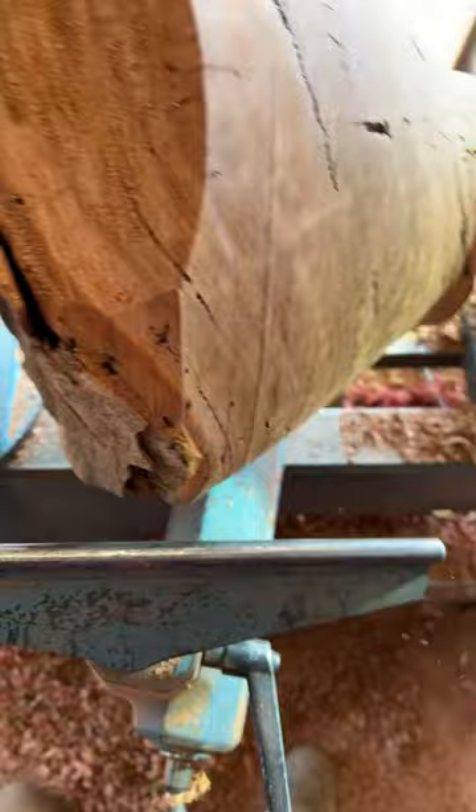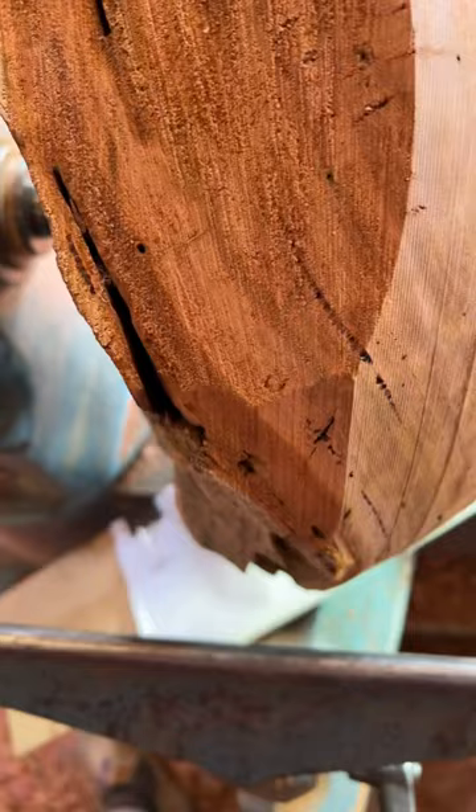So that's an example without this white sheet of paper that I've got here, clipped onto my template when I'm bowl coring. I'll put that underneath there on the banjo - it shouldn't hit it there. Then turn the lathe on and you can see that edge really clearly now, where to start and where to stop. So hopefully that helps someone else out - cheers guys, bye.